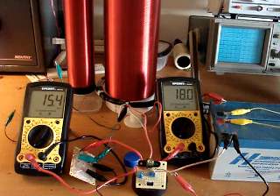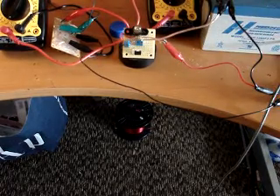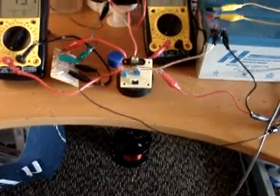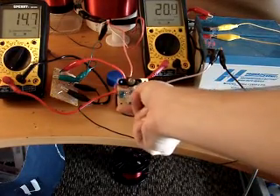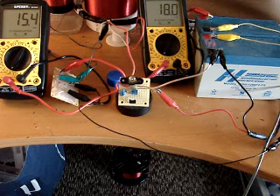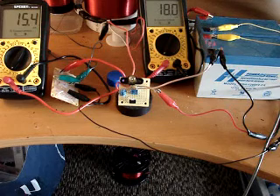The primary coil — the big red one — basically acts as our matched or tuned load. What happens is we receive a very high impedance point when we drive this thing. As you can see, this input bulb — a little tiny flashlight bulb, the kind you use with C-cell batteries — the filament is completely dim, there's not nearly enough current to light it. And this switching MOSFET, the IRF510, feels cold to the touch — it doesn't heat up in the slightest.